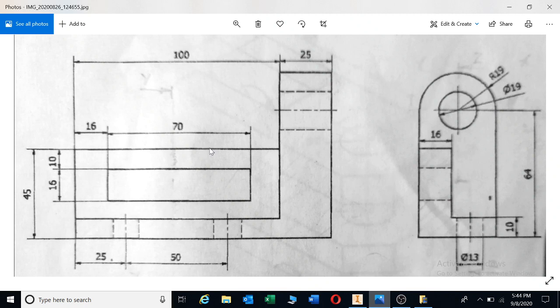Looking at that height going straight across, we find that the only part that matches that height — the width — is 16. So there are two extrusion distances. From this side, I would also have two extrusion distances: one geometry going across at 25, and then that geometry going out to 86. Because we're extruding from a flat drawing, you extrude from this point and fill up to get that geometry, then extrude this one straight from the back — so it's 16 plus 70 plus 25.